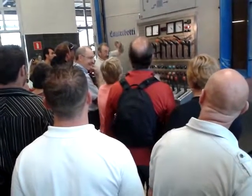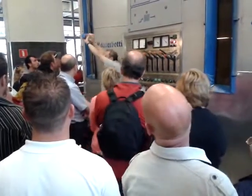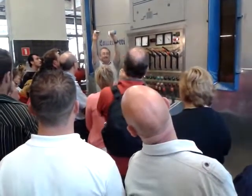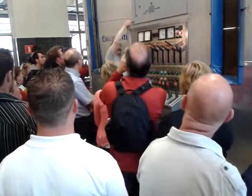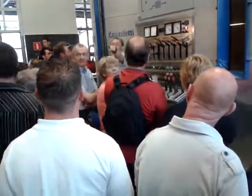When the clarified wort is in the brew kettle again, we add hops, hop pellets, not the flowers. And then we boil it one hour or longer, depending on the type of beer. And then we pump it into a whirlpool. It's not one from Philips.